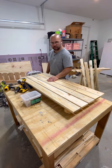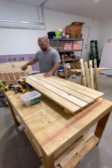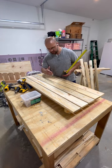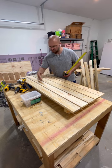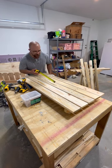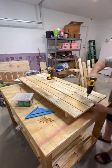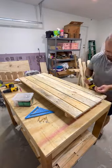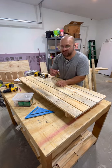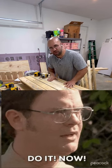About to screw the tabletop to the base frame. We're going to be doing three inches from the end on both sides. Honestly, you can cut a little spacer to make it perfect, but this is a kid's picnic table — it's gonna be outside, so we're gonna wing it and eye it. Pre-drilling takes longer, but you don't have to worry about the wood splitting, so I recommend pre-drilling so you don't have to redo steps you already did.